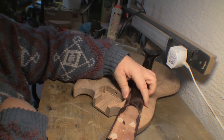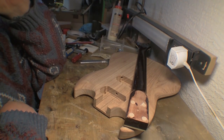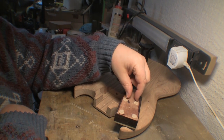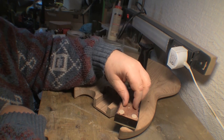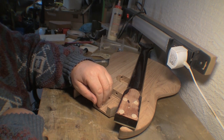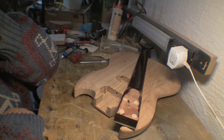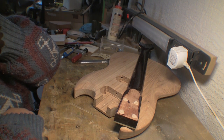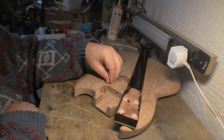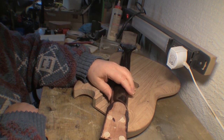The first thing I'm going to do is reroute around here to take the neck, see if I can get the height all adjusted, and see what space is left underneath that I can put additional wood. If I can, I'll glue an additional heel piece on here for additional strength and rigidity, running it into the pickup pocket. If that all looks good from a dry-fit perspective, we'll carry on. If it looks like it's just not going to work out, I'll either get a different blank or, as a last resort, abandon the neck and make a new one — though that rather defeats the purpose since I want to salvage at least some of the original instrument.